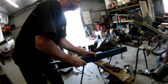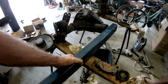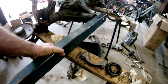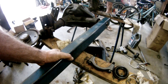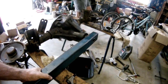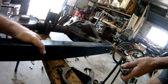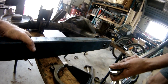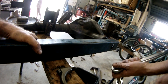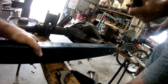Just pop that little collar there. It's a dodgy bar but hey, it does a job. Let's get the old torque wrench on it - need a short bow on that. A lot of blokes don't like these clicker types, but as long as you get them recalibrated and once you're finished with them, crank the pressure back off them, they should be good. Honestly, we're not building aircraft carriers or planes. It's a hundred and fifty - that's as good as it goes - so we'll put a hundred and fifty on.